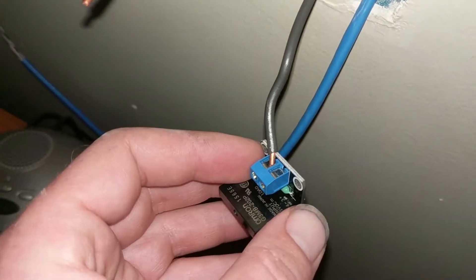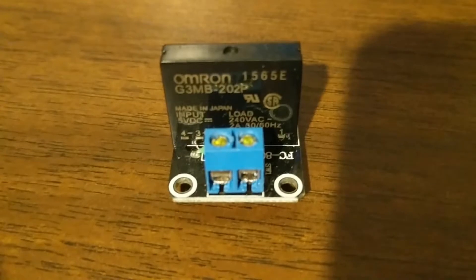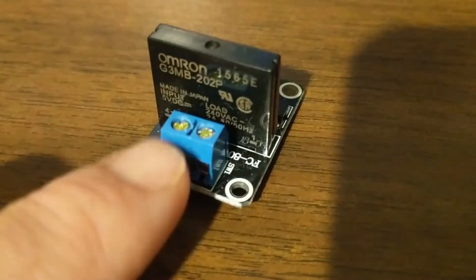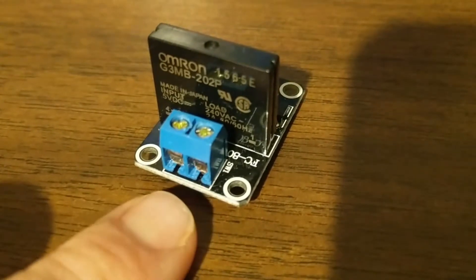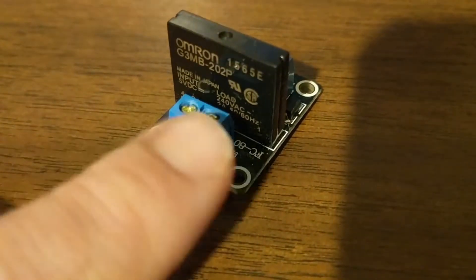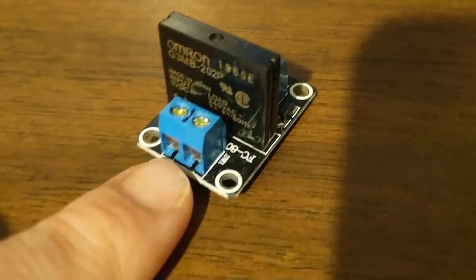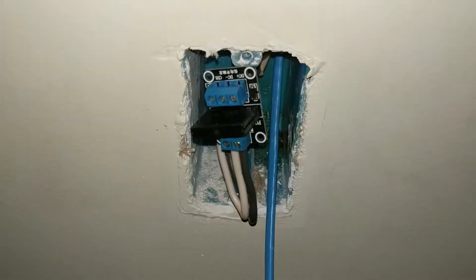You don't want any copper showing when you plug this in. Unfortunately, these relay terminals will not fit on the Romex in my house, which I believe is 12 gauge — these terminals are probably only rated up to 14 gauge. So I had to swap this terminal out for one that would work with my Romex cables. When I tried the original terminals, I couldn't get them to tighten down and the wire would fall out — a big hazard. Get relays that fit the Romex gauge you have.